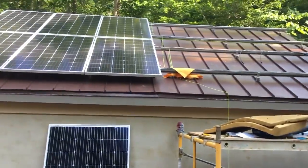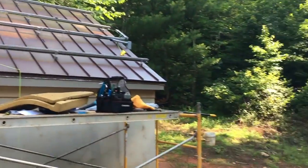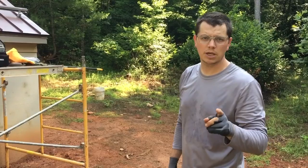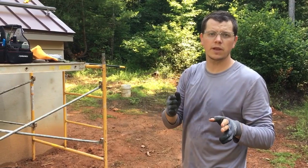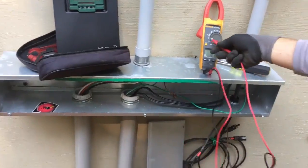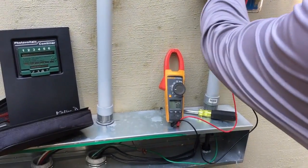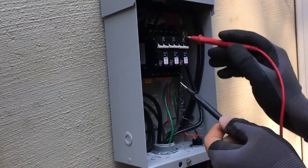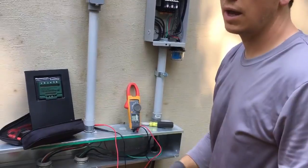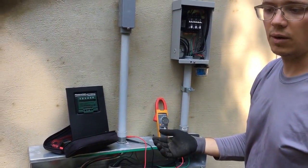So look at the panels — we're about halfway done mounting panels right now. We've got one full string connected. Solar installer pro tip number 342: don't wait till you put all your panels up to check your strings and see if you've got good voltage. Go ahead and check it every time you get done with a string — you'll save yourself a lot of headache. I got my combiner box open, got it on DC. Take the negative, put it on the negative terminal, start checking your leads. Nothing on that one, nothing on that one — 146 volts DC. That is the open circuit voltage of this array right now; it's not that hot outside. Save yourself a headache — check your voltage as you go, after each string. You can just have somebody checking it. You need to know if you've made a mistake instead of thinking you're done and then realizing you've committed a grave error.